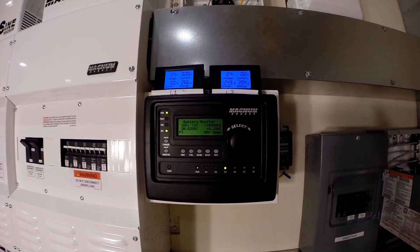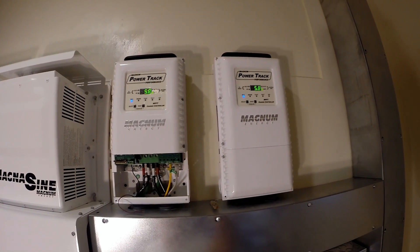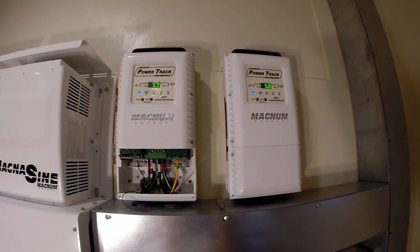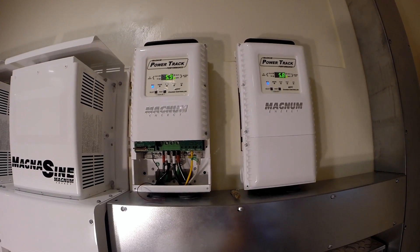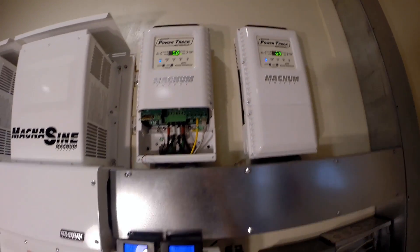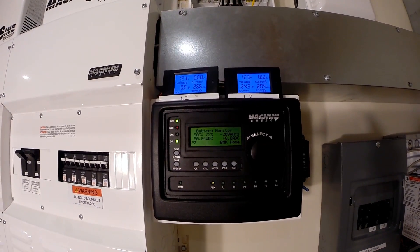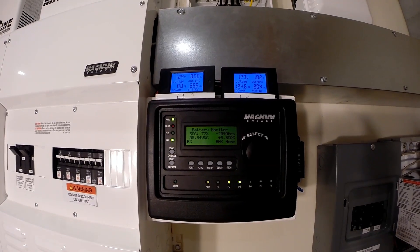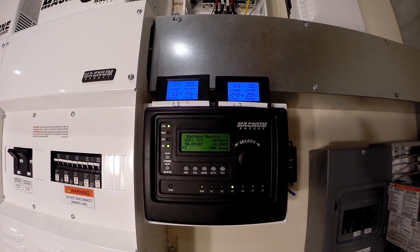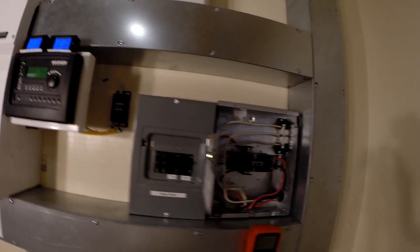It got down to 71 overnight. We're getting about 11–12 amps coming in at 52 volts, so that's about 500–550 watts coming in off the solar panel, and it is starting to charge slowly — we're up to 72 percent. But we're going to hook the generator up and switch it over to charge the system off the generator, which I haven't tried yet.